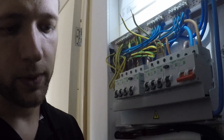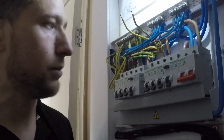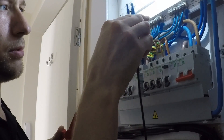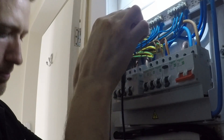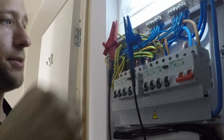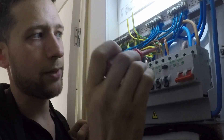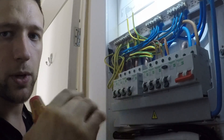So we'll have a look - this is why I'm doing this, so you can follow the calculations as I go along. Same again, pop the leads on - and we've got a reading of 0.85, which was spot on. That basically confirms that we've got continuity on the live, neutral, and earth. We've got complete continuity, so we know the ring is intact and it is a whole ring.